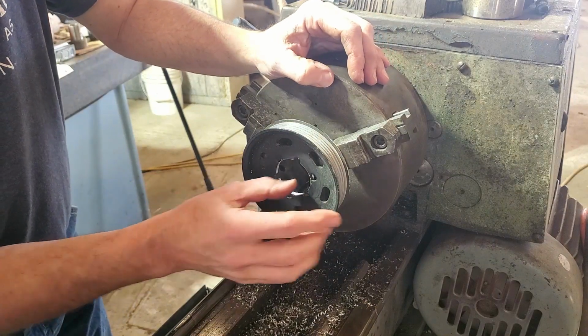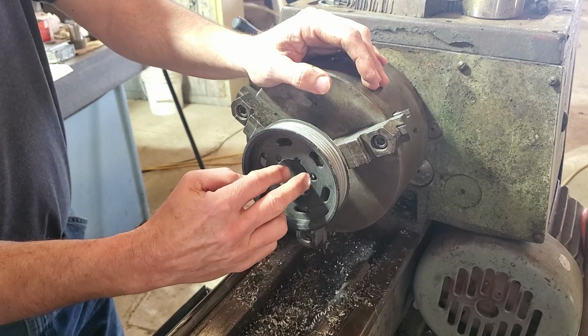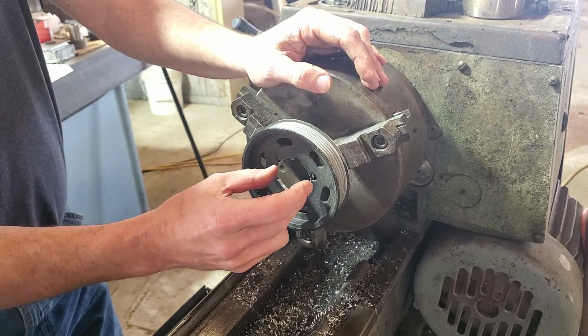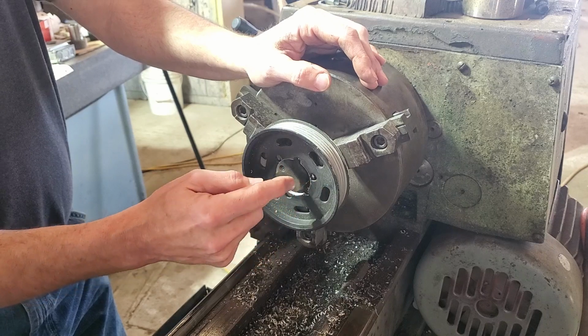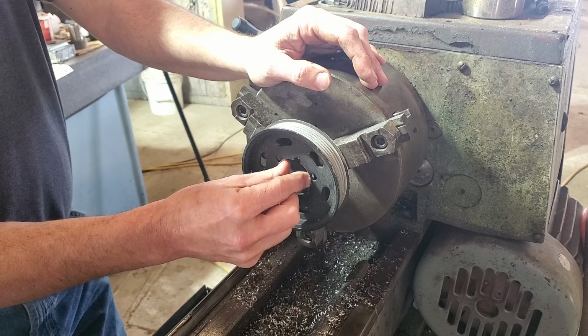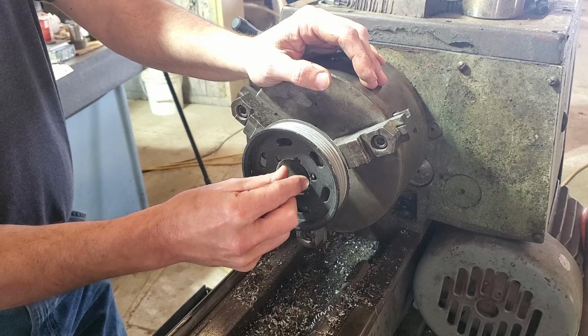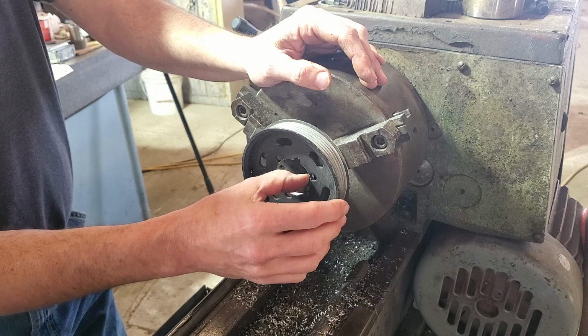I think the proper way to measure this more accurately would be with my sliding parallels that measure hole sizes. They only go up to an inch, but if you slip a gauge block in between them to spread them apart, you can measure bigger holes than that. And that's in the other building. So I'm pretty close to where I need to be.